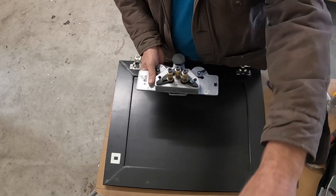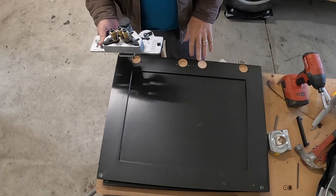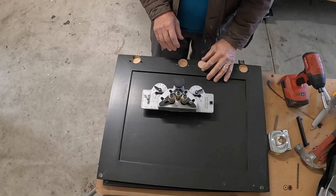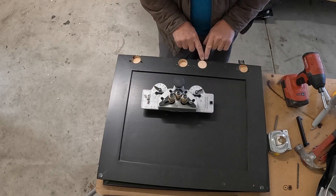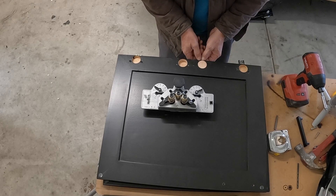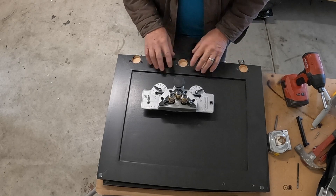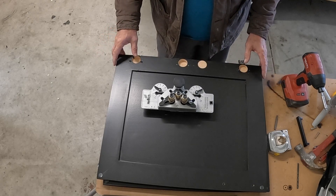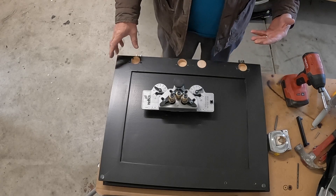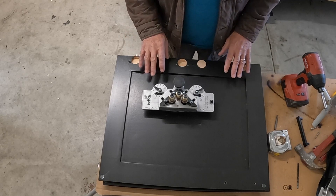What I did was I got my first door, removed the hinges, and set my depth. The first one I cut was too close to the edge, so the door would have been off-centered. I changed that setting and moved it over — it worked great. The two doors I installed lined up with the existing holes in the frame and I was super happy with it.